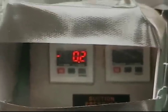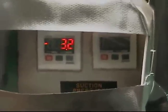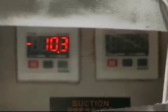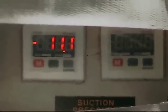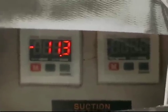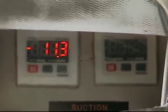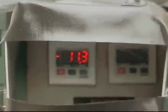Now this blower is going to pull the system into a really deep vacuum, because this pulls, I don't know, like 44 inches of water or minus 11 kPa. So right now I have the air intake blocked, and that's why you're seeing it build up in a vacuum with no fuel in it. You're seeing minus 11.3 kPa. It's about 44, 45 inches of water.